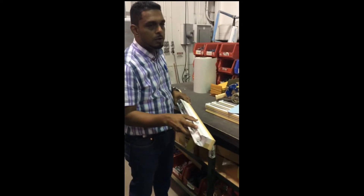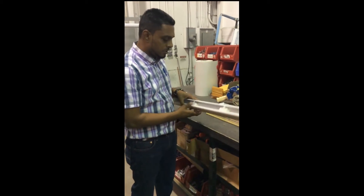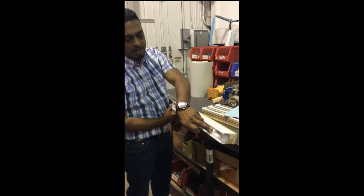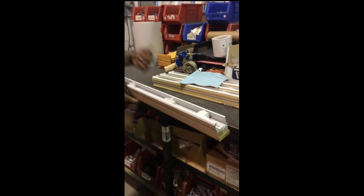The most important thing with cordless is the way you install the brackets. I'll demonstrate a few things. See where the bracket is installed right now? Right on top of the motor. This blind came back because the motor is not retracting.